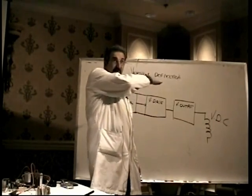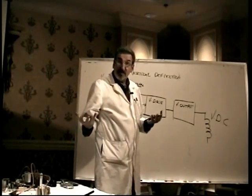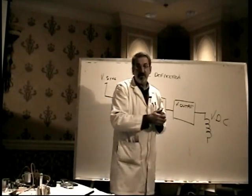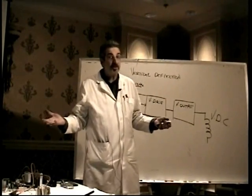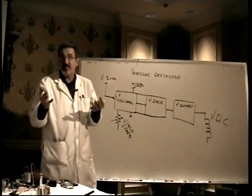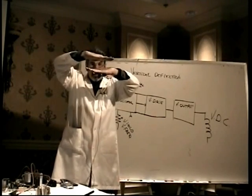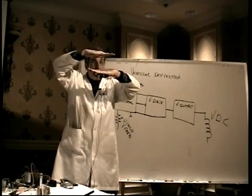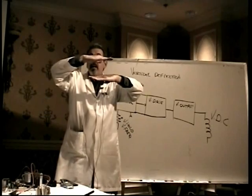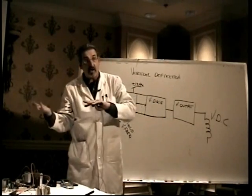When you have just a flat line on the screen, just a straight line, the first thing you suspect is that the vertical output chip has failed, because it's really, really a super common failure. I will tell you now, though, that it's been my experience that if you have any vertical deflection at all, maybe it's only this big, it doesn't fill the screen totally, the chip itself is good. In my experience, it's been a catastrophic failure or it's working.